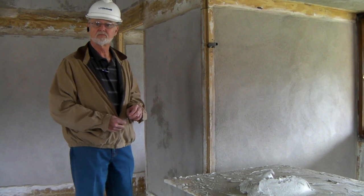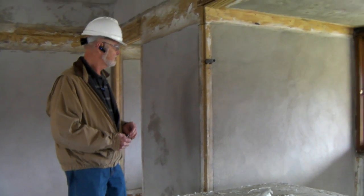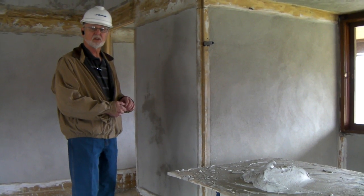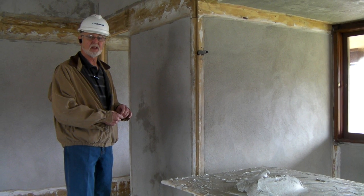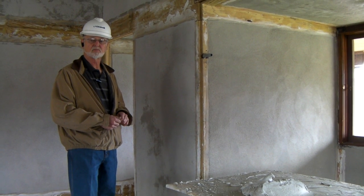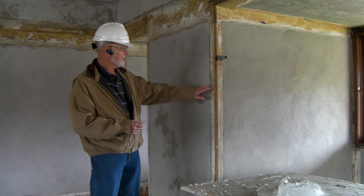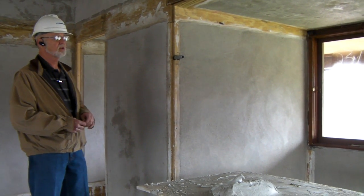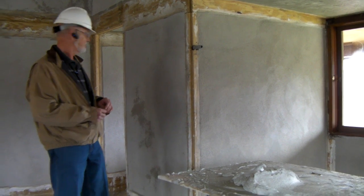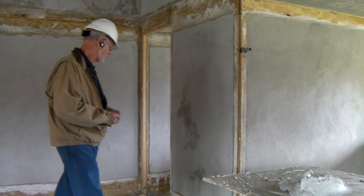So, is that three coats? It's three coats. It works out to be three-quarters of an inch of plaster. And if you want to get a feel for the weight of it, you take a three-quarter inch piece of granite, and that's the same weight as this plaster. So, we're adding a lot of weight back into the building. Of course, it's had it before. All of the wood that you see that's exposed is where the new wood trim will be applied vertically, horizontally, along the floor as base.